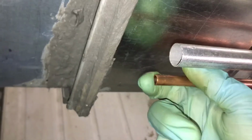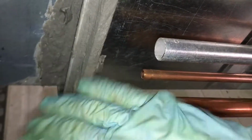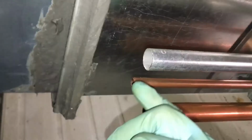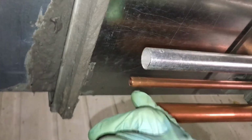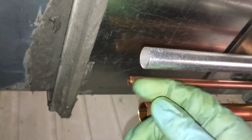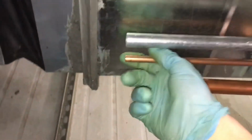So you get down here and you put your upper lip, if it's a little sweaty, or wet it, and then let the nitrogen flow. And when you feel it, you won't be able to feel it on your hand. You might not be able to feel it on your cheek, but your eye and your upper lip are very sensitive skin when they're moist. And even the slightest flow, you can feel the flow. So that's a little secret.